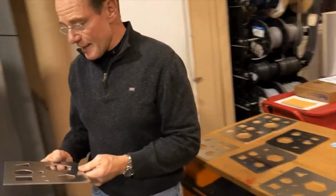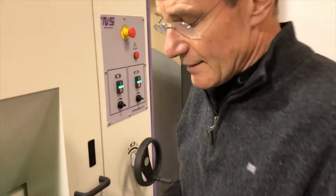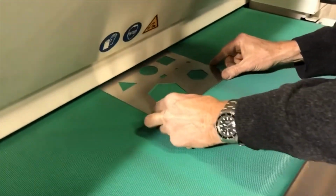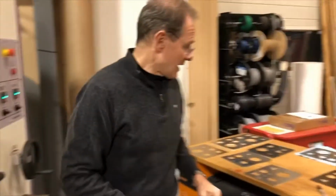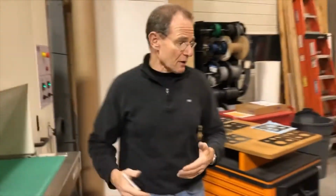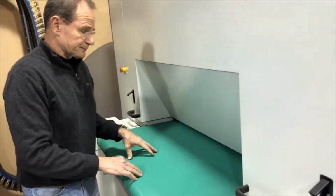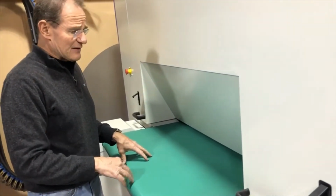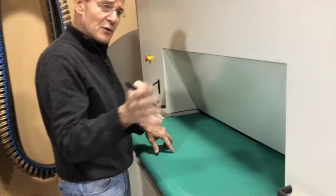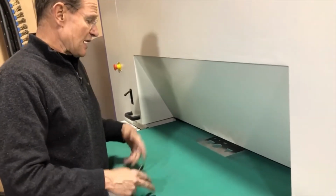We're going to do the same thing, only we're going to start not at 2 feet a minute, we're going to start at 3 feet because the aluminum is softer and it will deburr better. And then the volumes correspond obviously to the stainless steel at 3 feet per minute. That doesn't make a difference, so it would be about the same 1,200 parts per hour. Extremely productive and very simple to set up. You see how quick we go between the different materials and the different speeds.